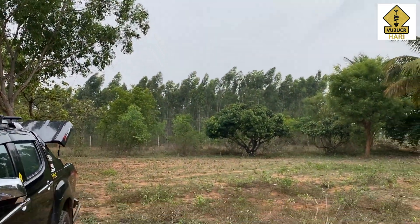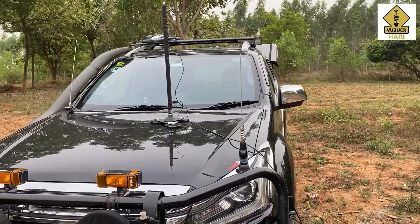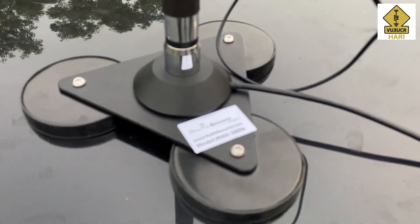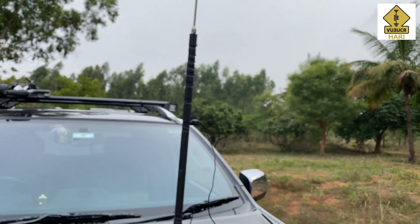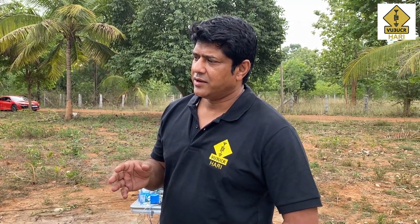It's very easy — as you can see it's gone up about 35 to 40 feet and right down to my cable. Coming to this mag-mounted vertical antenna, which is adjustable from 3.5 MHz to 50 MHz — this takes all of 2 minutes to set up, though it takes a little time to tune the top element. Especially on 40 meters it can be tricky because a couple of millimeters difference in height makes a huge difference in the SWR. The best we could get was an SWR of about 1.69 to 1.7, which is pretty good — and I feel this would work really well in outdoor areas or where there is not much RF interference.